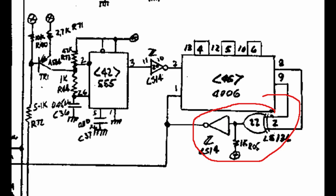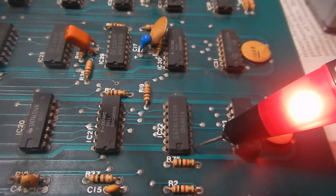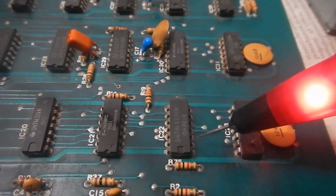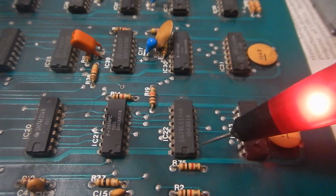The bad news is that I was too quick in concluding that the shift register was faulty, because it could even be that the feedback gates are bad and their output is stuck to the logic 1, and in this case all the shifter taps will be always 1. The good news is that I can now use the added socket to check which one of the 2 feedback gates isn't behaving correctly by pulling up or down the inputs of the first gate. So I've set one input high and the other low. The output is low, but that's wrong for the exclusive OR. It should be high.